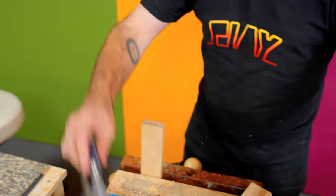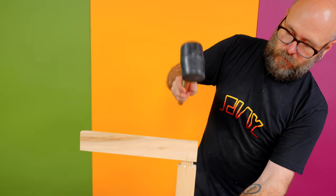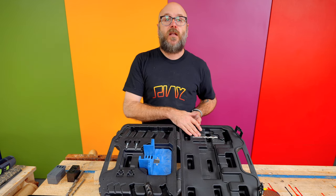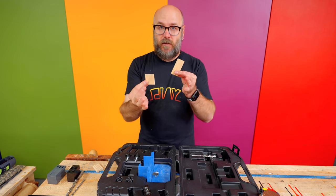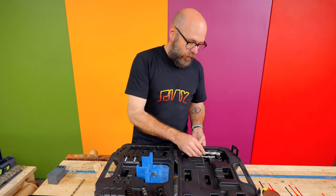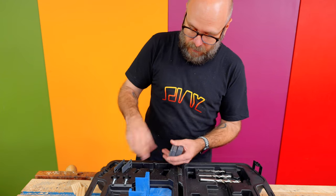Now we can take the jig off, add a little bit of glue in there, and pound that in — that is going to be a really strong joint. The kit comes with a case, the jig, the insert, and the drill bit, and that gives you this size tenon. The really cool thing about this kit is if you need a smaller or bigger tenon, you can add on to it and the case already has room for it — there is the half-inch insert as well as the quarter-inch insert, and those come with the drill bits. On bigger, odd-sized pieces, you'll either have to make spacers or Rockler also sells spacers, which also fit in this case.